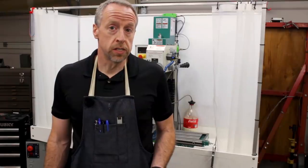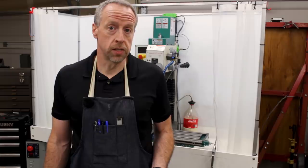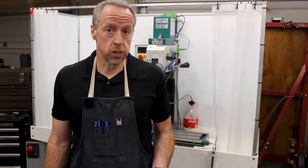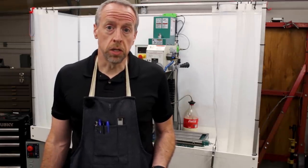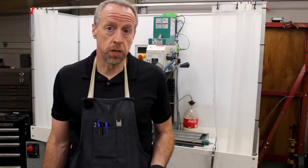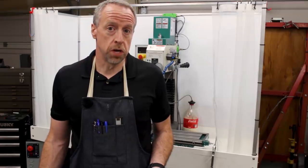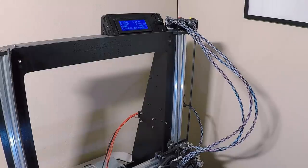Several people suggested that the parts aren't really shrinking, and that the real problem is just that my printer is old and isn't adjusted properly. That's a possibility, so it's worth a check. So I took a caliper and measured the movement of the axes. Now, I measured both X and Y, but here I'm showing the measurements on the Y-axis